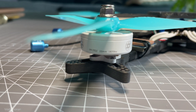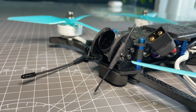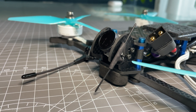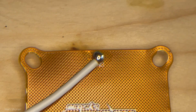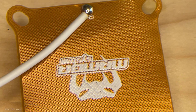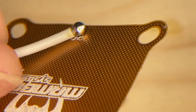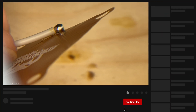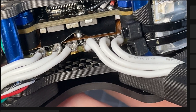The first thing, and one of the most pressing ones, was the camera — the cable was just too short. I swapped it out for the original DJI camera with a long cable. That has the effect that the quality itself is better now, because the original DJI camera has basically the best quality of all cameras the DJI digital system can provide. And on top of that, the camera plates on the right and left of the camera cage are no longer in frame.